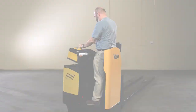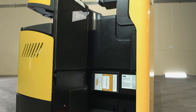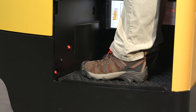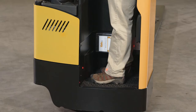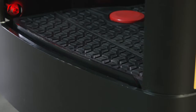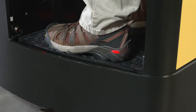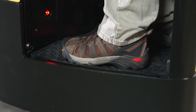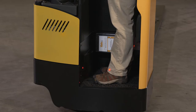Fault 2 — Cycle Left Leg: This occurs if your leg sensor beam is broken after key on. Move your left leg to connect the beam and then put your left leg in position to break the beam. You will hear a beep. Fault 3 — Position Right Leg: This occurs if the right leg sensor beam is broken after key on. Move your right leg to connect the beam and then put your right leg in position to break the beam. You will hear a beep. Fault 4 — Cycle Egress Curtain: This occurs if the egress curtain sensor beam has not been broken after key on. Move your left leg to break the beam and then put your left leg in position to reconnect the beam. You will hear a beep. Fault 5 — Cycle Brake: This occurs if the brake has not been depressed after key on. Depress the brake after key on. You will hear a beep.